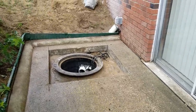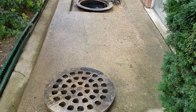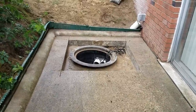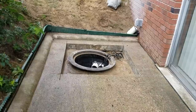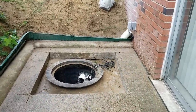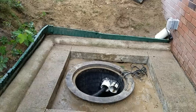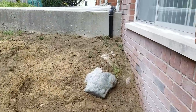Instead of doing all that, we just cut out the drain and put in a lift station. This won't be a solid cover — it's going to be a grate — and when we put the cement around here it's going to be angled downward like a funnel, so all the water goes into this five-and-a-half-foot-deep sump crock basin. It's basically a lift station. When it fills up, there's a tether float on the pump, and we adjust it to the height we want it to start pumping water.